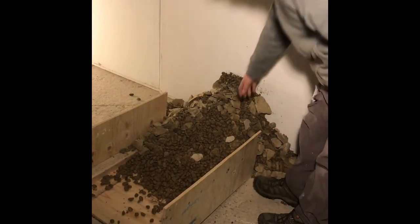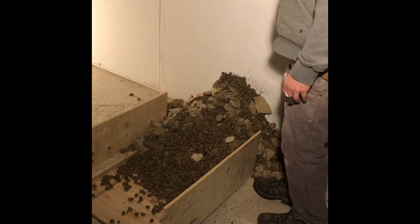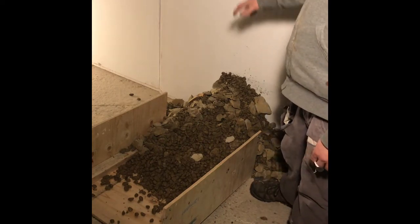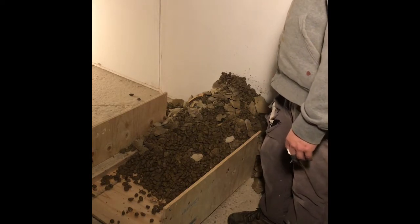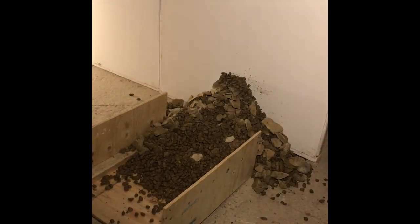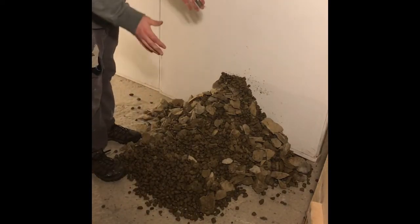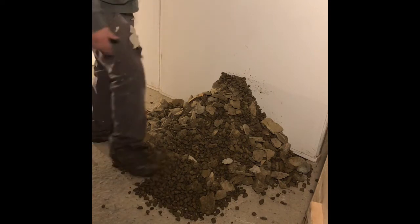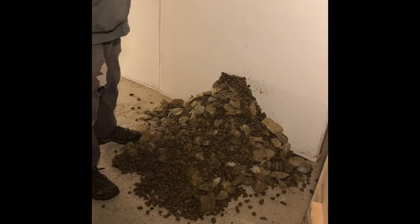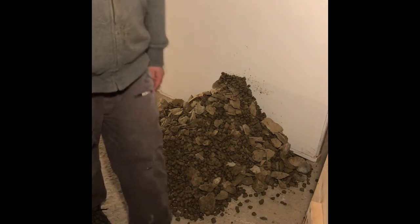Just as I suspected. When you add loose material like this behind your walls, it doesn't hold any structure. What's happening is it's actually creating pressure on the face of your wall, as well as any pressure coming from the bank and erosion from the bank. Some products in the industry are only eight inches thick, and then you're piling stuff like this behind it. A few years down the road, it's pushing over and ruining somebody's property. So stop putting gravel behind your walls.